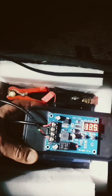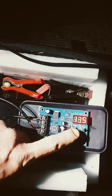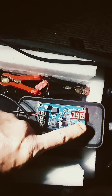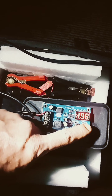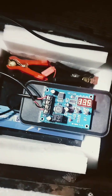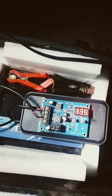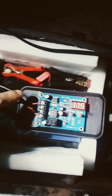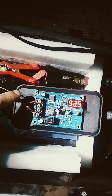You just set your voltage — the lowest voltage and the top voltage. My lowest is 13.5V and my top is 14.5V. That way you can keep your batteries always at a good voltage and get more years out of them.